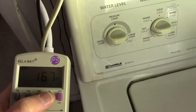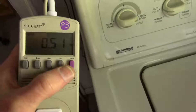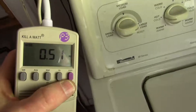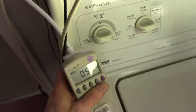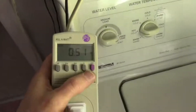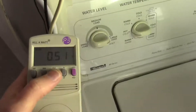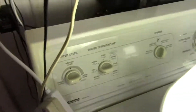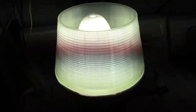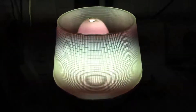That means the power factor is pretty poor — 0.51 — that's not so hot. If you were so inclined, you could use a capacitor to correct the power factor, using the proper type of capacitor of course, to bring the volt-amp draw pretty close to the actual wattage draw. Anyway, that's about it for this — the mercury vapor light fixture resurrection. Thanks for watching.